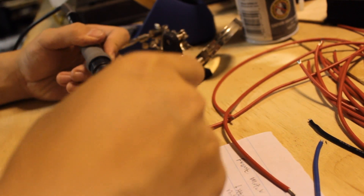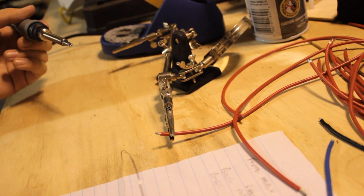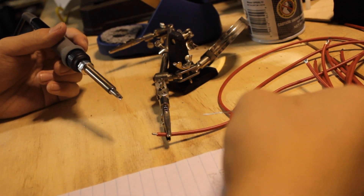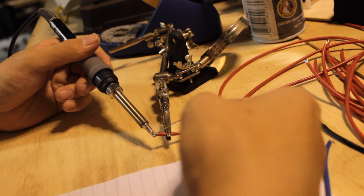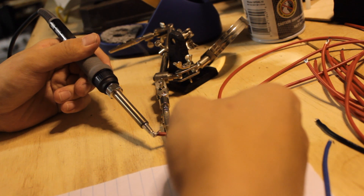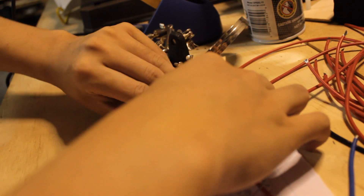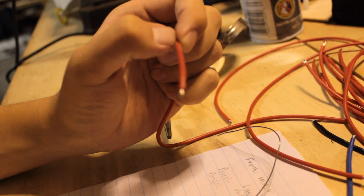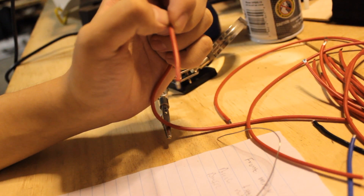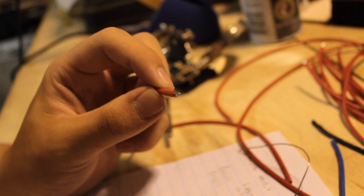Now repeat tinning for the remaining wires. Then we want to put the wires on. Place the wire on top of the solder pad and gently touch your iron to it. It may take a while to melt the solder, but once you get it in you'll feel it. Add a little more solder if needed. One thing to keep track of is how good the solder joints look — if it's muddy, that's not good. You should have a shiny solder joint. If you mess up, redo it.